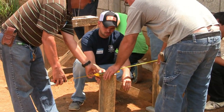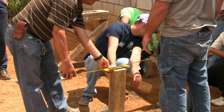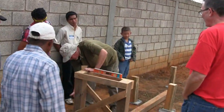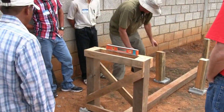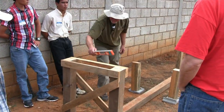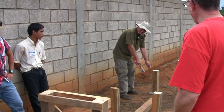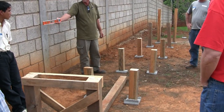Yeah, you got a 4x4 here. See, make a line, and that's the top of the 2x6. So we can draw a line here. It'll come down from the top, and then that should put us pretty close to this. And we'll just adjust it with the level until this is level. Okay? And then we'll attach it here. And then we're going to have probably a splice in here somewhere. And we'll continue all the way down. All right? There you go.